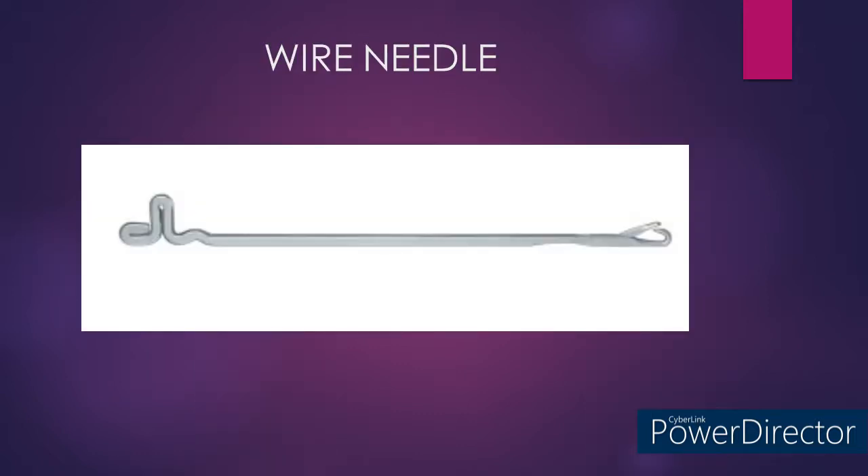Wire needles are made from a steel wire shaped through various machining steps to create a desired profile and a hook, the section accommodating the latch, and an end butt with the tail. The manufacturing process with the wire needle is the simplest and most cost effective one, while the die cut process gives better technical results and imparts greater stiffness to certain sections of the needle.